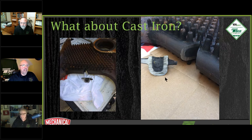And what eventually happened? They cut this section out because right on the bottom side there was a crack that went in this direction. Now you would think it's going to happen on a seam. It's not a seam, it's where the casting is, but it was perpendicular to here. A crack in this heat exchanger, and it was less than 5 years old because it just got plugged up solid. So you also need to consider water quality when it comes to your cast iron brothers.